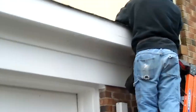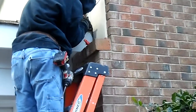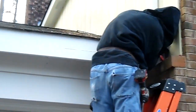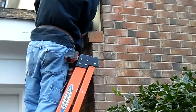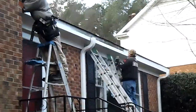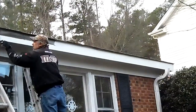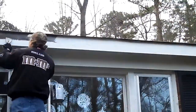It's just an extreme difference in the looks — it really looks like a finished product, like you really care. What Jeremy's doing over here on this end, he's actually had to cut the siding back to install kick-out flashing that previously wasn't installed, to actually catch the water coming down the siding and direct it into the gutter. I wanted to point out the difference between leaving that bare and just putting a gutter over the top of it versus caulking everything up and painting the fascia before we put this new six-inch gutter system in place.